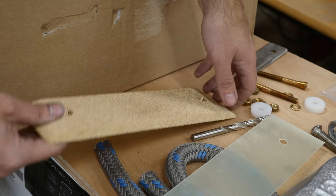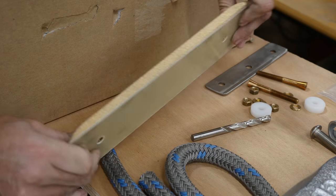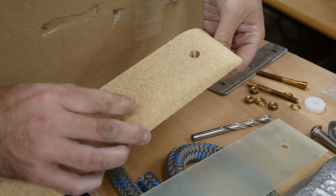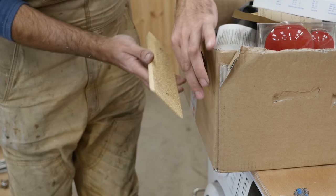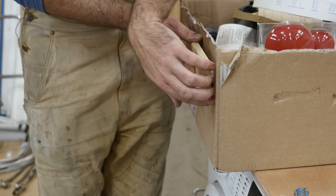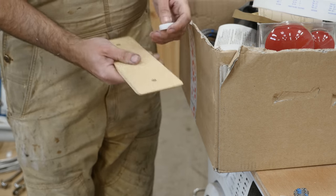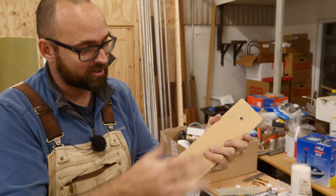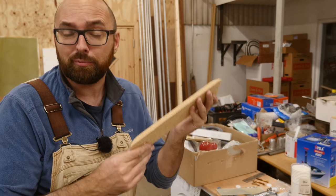If I'm not mistaken there are two ways of mounting these ground plates. One is to mount them directly onto the hull. Another is to use some little spacers in between the ground plate and the hull, but I'm going to go for the first option. Having this thing mounted with a spacer so that it sits proud of the surface like some kind of hook waiting to grab onto something doesn't really seem like a great idea. I imagine mounting it with a spacer maximizes contact with the water making it perform better, but I don't think it's worth the risk.